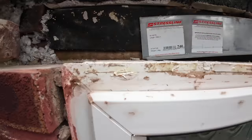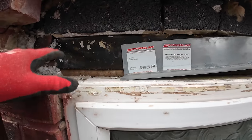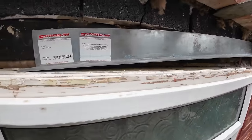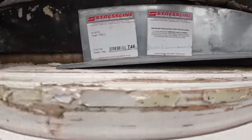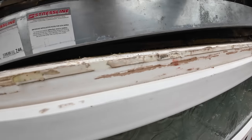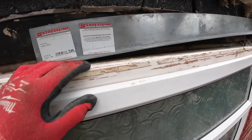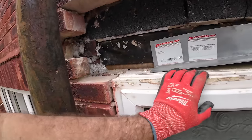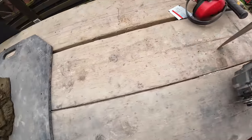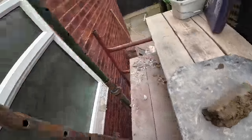Tried the lintel, and as you can see, the frame's slightly high, so we need to sit it down as tight as we can. So it's from about halfway, so luckily we've got the little grinder with us, so I'm just going to take the fins off the top of the frame. This is great, because this is going, we don't have to worry about it, we'll just get on with the job. Saves us a lot of time, a lot of messing. So Alex, just get me a mask. I've got the little grinder, I'm using this more and more lately. Back this off.